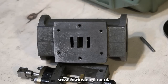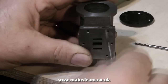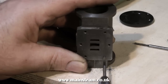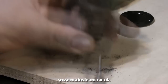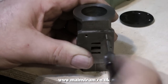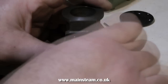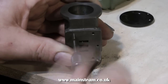Here we have the cylinder's port face with six holes drilled in it, which are all the same length, and now I'm using a tap to tap the holes — but not at this speed; this is speeded up to stop anyone slipping into a coma whilst watching the video. The holes in this casting at this point on the port face are quite deep, so I'm using a taper tap first and then I follow it straight away with the plug tap to get down to the bottom of the holes. You need to have a touch like a midwife when doing this because it's very easy to break the tap, so take your time with it.